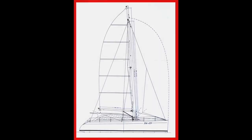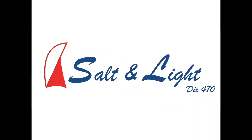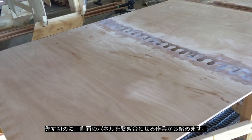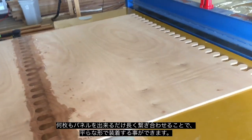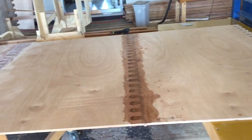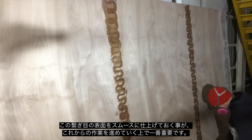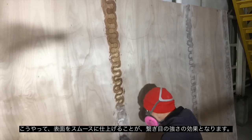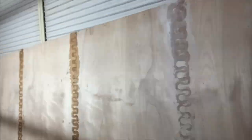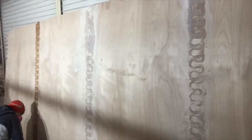And we'll look at how those bolts are held in. To start the process off, we glue as many panels together as we can. That will give us a nice flat surface to work with. The surface preparation is absolutely key to making sure that you get a really good bond with the resin. Here I am, just sanding off the back of the panels that have been glued together, just to make sure that I will get the absolute best bond I can when we finally glue these onto the stringers.